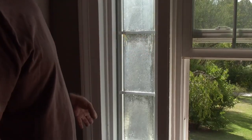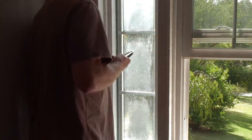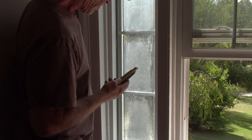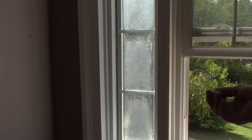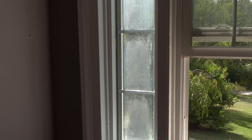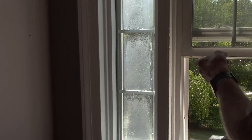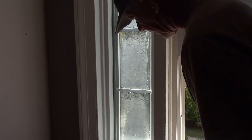There are little plastic standoffs that center the window in the frame. Now I want to climb outside and try to cut in behind there. I'm going to get a putty knife because I don't think my razor is going to get in behind there. Some windows have glazing tape and some have caulk - we're going to find out which this one uses.